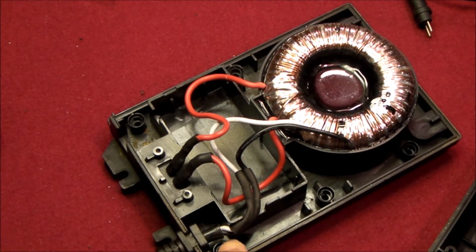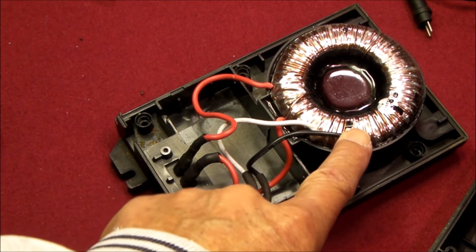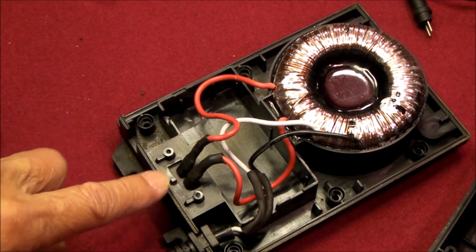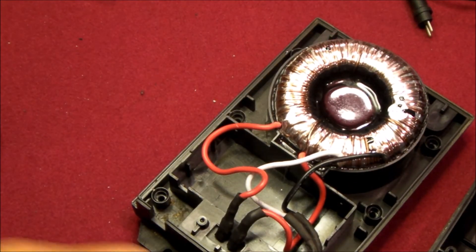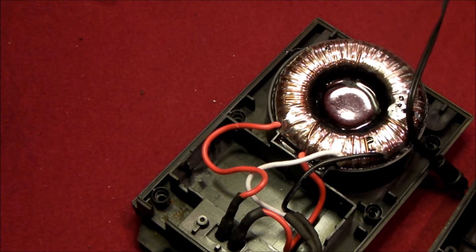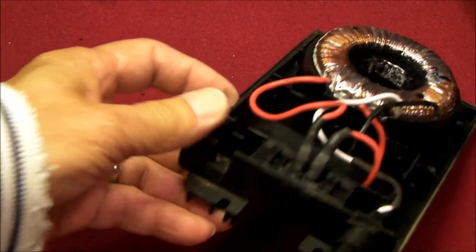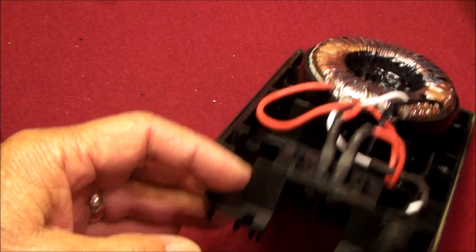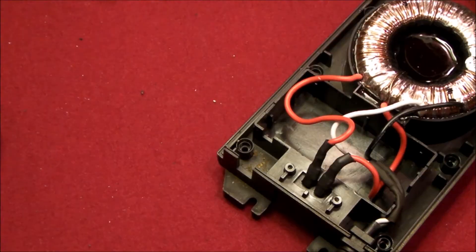There it is. Power comes in — the black power lead goes to the black transformer wire, white goes to white. The two reds are where they originally were, going to the terminal block which connects to the external lights. Here's the control board that I removed, and I've also removed the photo cell. I'm going to leave the keypad in place since that keeps water out of the enclosure. But I will have to close up this opening here, which is where the photo cell was — I want to put some silicone in there to keep water from entering the enclosure from that spot. If you decide to seal this hole up with RTV, just make sure you leave that drain hole right there open.